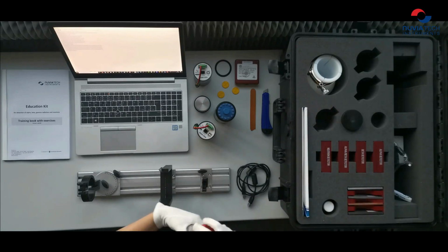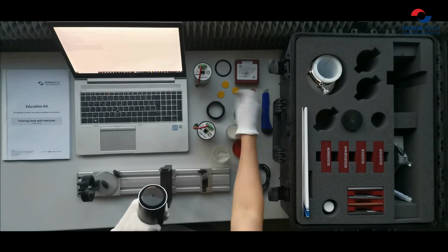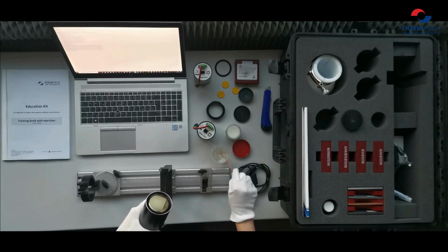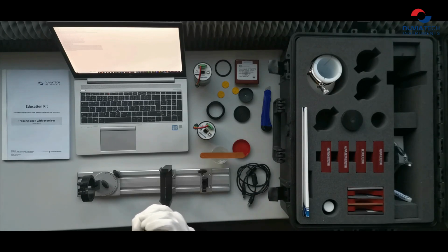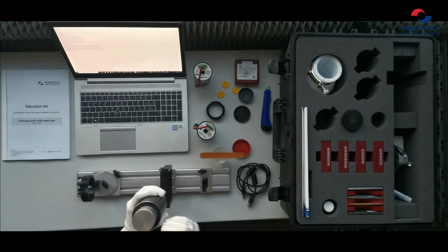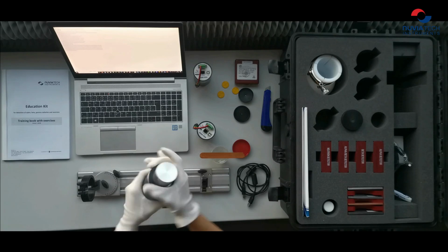Firstly, you need to couple the scintillator to the photomultiplier by using optical grease. So remove the black cap, which is covering the photocathode, and then apply a slight amount of optical grease to the photocathode. And be sure that both surfaces are clean in order to ensure proper contact. Then apply black foam and screw the black cap back. So now we have it like a probe.